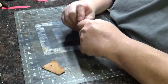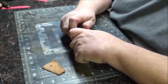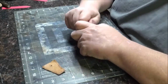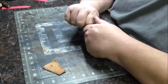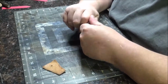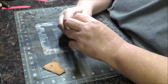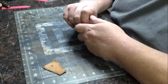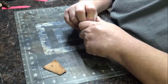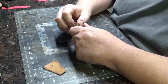I do have one other piece that I need to make, and that's that other strap. And I think what I'm going to do is grab a piece of 1-inch wide strap, about 8 inches long or 10 inches long. I got some cut already. From what I'm able to deduce from the pictures that I have, it looks like it's about 1 inch wide. I need to go get some round bar, and I'm just going to get some cold rolled, so I shouldn't have to heat anything to bend it.